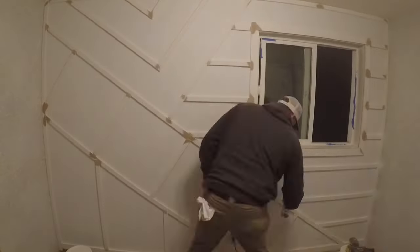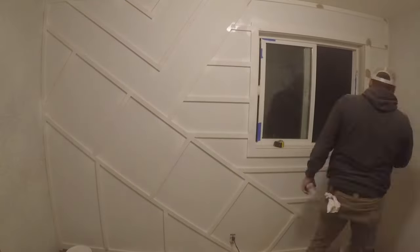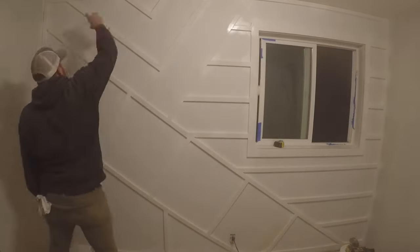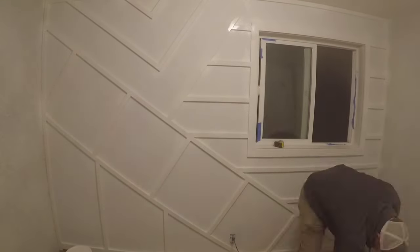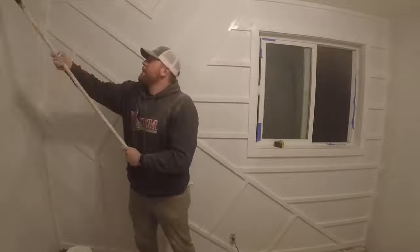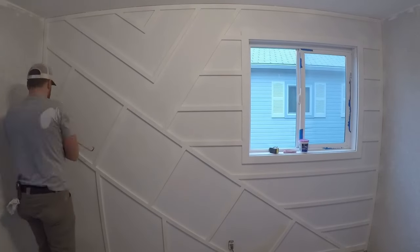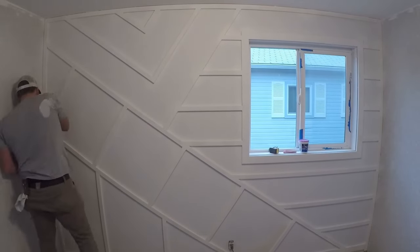You can see that opening the window made a significant difference. After all the sanding, some MDF was actually exposed, so I just took an all-purpose primer in a spray can and went over all of those pieces to make sure they were primed and had good adhesion — it worked out really well. After it dried, I went back with some 220 grit and lightly sanded, then did a quick sealing coat.